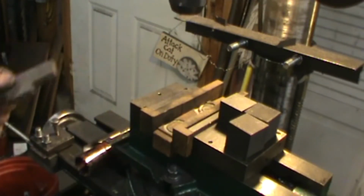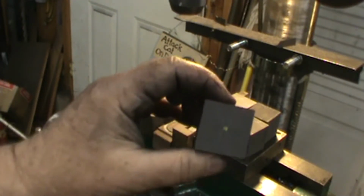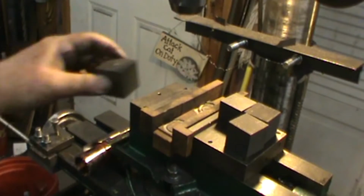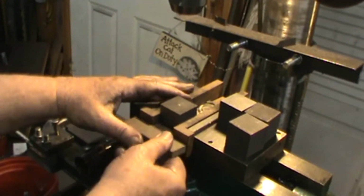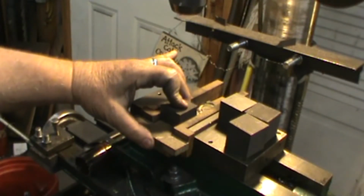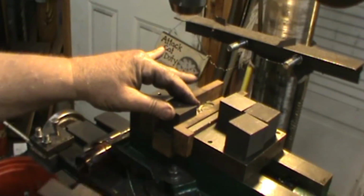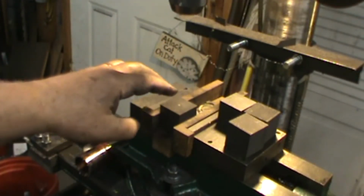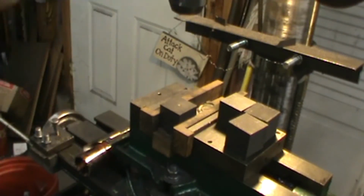And then this jig, that's my little alignment jig. So starting out, I'll put the already marked center point of the cube. I set it in there, and then I just push everything forward, push the block up against it, and then just enough tension on the vise to hold it. That's all you really need, to hold it while the drill bit is leaving.